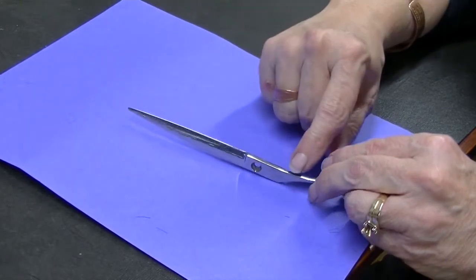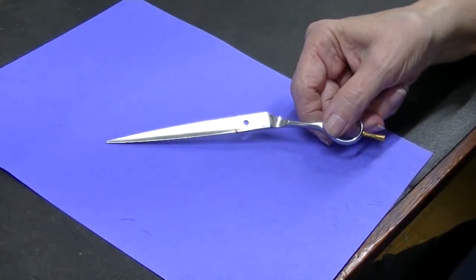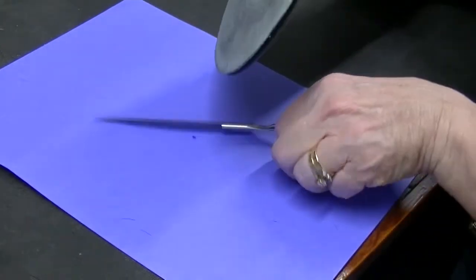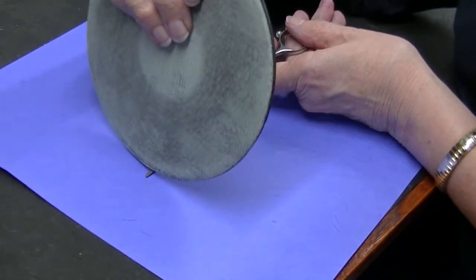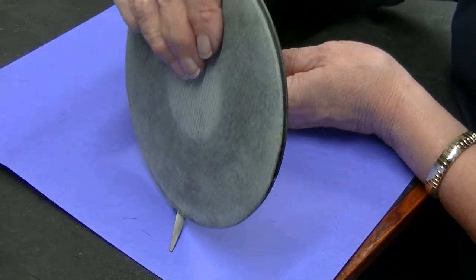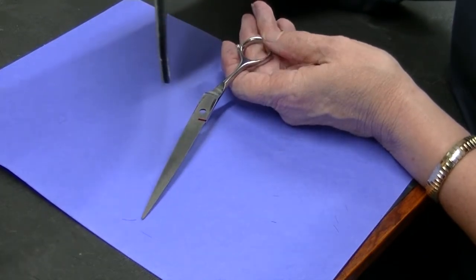There is a twist, but the twist is not created in the way you would think. The angle of the edge all the way down is going to be the same in every shear I've encountered. This hollow — when I turn it back and forth to the light, you can see how the light reflection goes at an angle. It's not going straight; there's an angle to the light. When the hollow was put in, it does not go from the back straight to the tip — it goes at an angle. That angle will vary from one factory to the other.